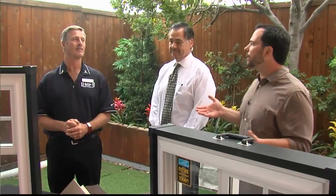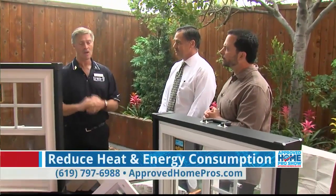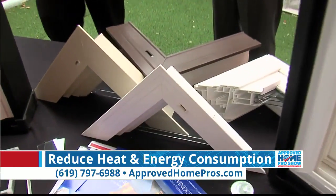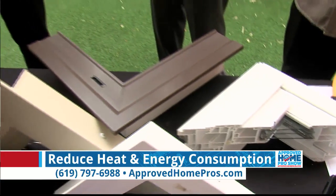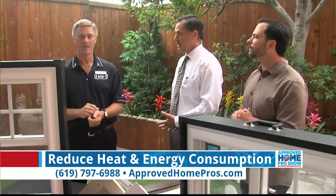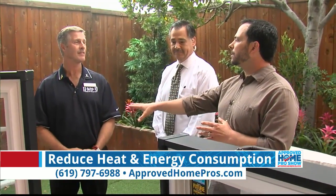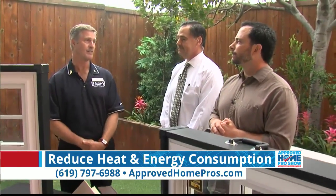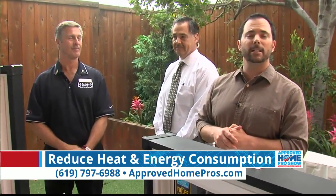She wants to know if it's going to change the historic look of their home. Absolutely not. There are a lot of different styles of windows — aluminum and wood. If she has wood windows, we can actually do what's called a block frame constructed window, which doesn't have the fin on it for stucco. We can cap the outside and all the existing wood and make that window look pretty much exactly like it looks now — no repair on the inside, no repair on the outside, no removing interior trim, no disturbing the interior of the house at all. We have five premium windows and a six-foot patio slider for $3,819 installed. The number is 619-797-6988.